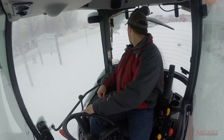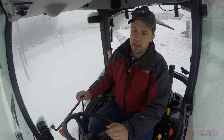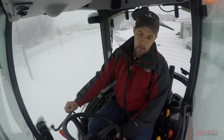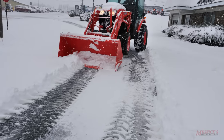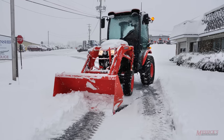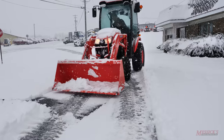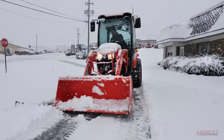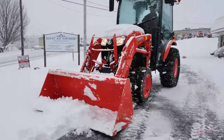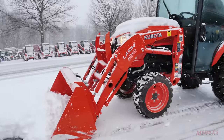You will see places here where I'm leaving a little bit of stuff behind. You can take the tractor and actually put the cutting edge down on the ground and then lift the front wheels up in the air and push like this. But notice how I'm fighting — I'm catching stuff, I'm pushing down onto the asphalt. I even dug some spots up right there, you can see. So that's not the way you want to do this. Use that float position and take the weight off the loader so you're not pushing down into the ground.